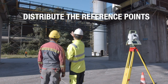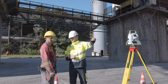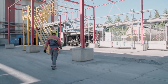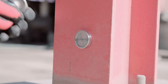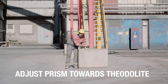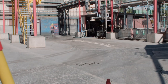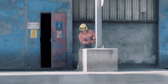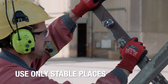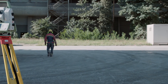The reference points should be widely spread in the kiln area. Look for stiff steel structures, preferably close to concrete foundations. Make sure the base magnets have a sufficient hold. Adjust the prisms into the direction of the theodolite. Any station should have four to five reference points in common with one of its neighbouring stations to achieve a high degree of accuracy. Do not attach reference points on thin, unstable, or vibrating structures, because the position might change during the measurement process.